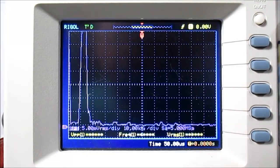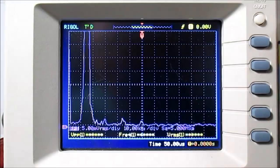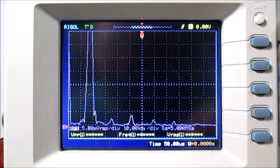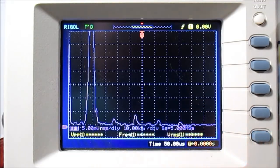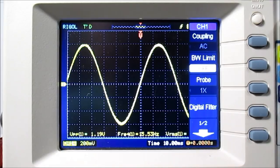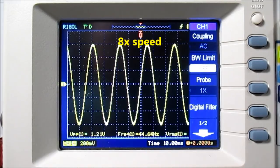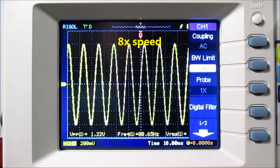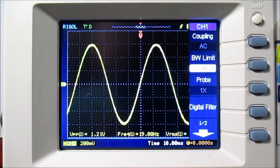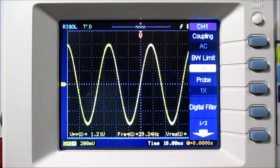I'm running a sweep and around 14 kHz there is a little blip of distortion, but it's nothing significant. It does change a little as the frequency changes. Looking at the 10 to 100 Hz sweep to see how the amplitude changes — after completing and starting back over, it is flat as a board. I was careful to have the bass and treble controls set completely flat.